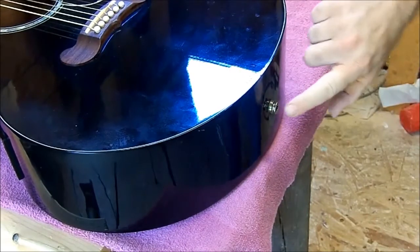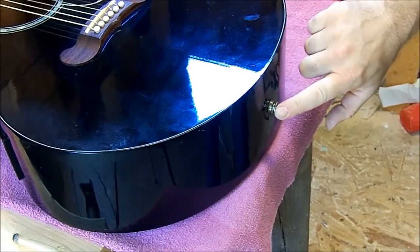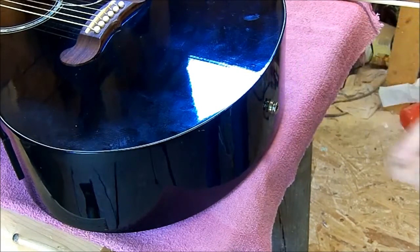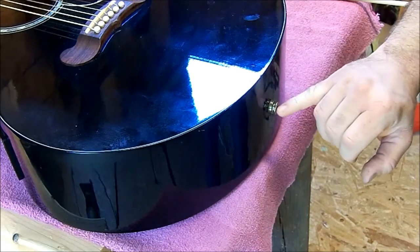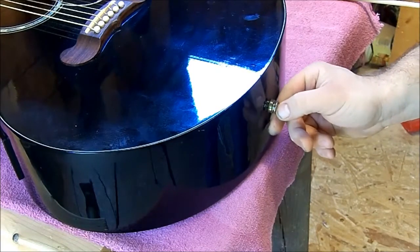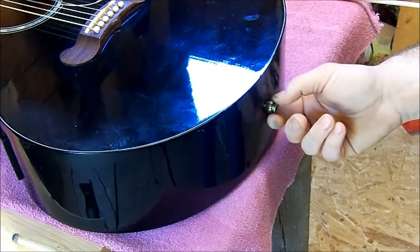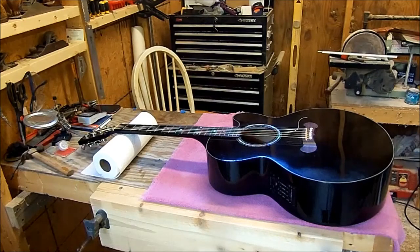It's a done deal. One thing you've got to look for is the jack here — you want that jack to be flush, or maybe just ticking out like a 30th of an inch or so. If the jack is up inside the strap button too far, when you put your cable in, the cable's not going to make a connection because it's not going in deep enough and you won't get any sound. So just make sure that jack is at least flush or sticking past the back of the strap button. If it's sticking in, you just need to take it back apart like before, go up in there and take like a half a turn off — half a turn should be enough to get it right. And as you can see, it ain't going nowhere now. Thanks for watching and I will see you in another video.